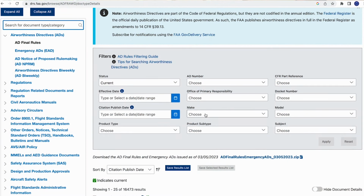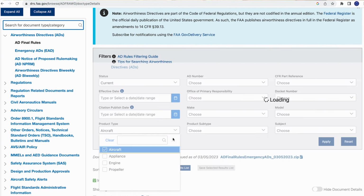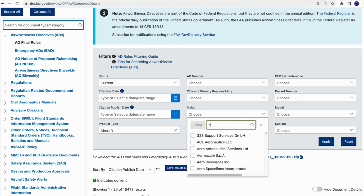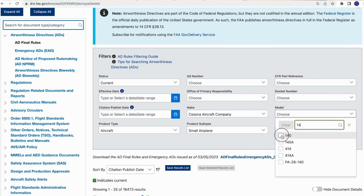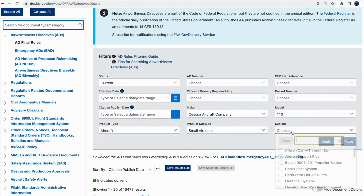For airworthiness directives, you're going to have to find an IA or assist an IA in doing the research on what airworthiness directives apply and see if you can determine if these have been accomplished by someone else, or if it's a recurring AD that it can be accomplished. The current inspection status of the aircraft is pretty easy. You need to have an annual inspection, and probably it's going to have a few records for the last few years, if it still has some, hopefully. There are instances where there are no records in which you need to complete the annual to suffice this.